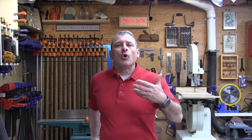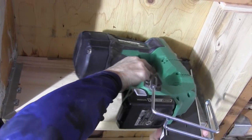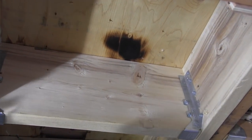Utilizing this sealed compressed air results in zero ramp-up time, allowing you to install up to two nails per second. The nailer is always at the ready — when you fire it, the fastener is installed with zero lag time and it's ready to go again, as the piston is automatically reset. One thing I noticed is that the recoil in this nailer is very similar to a pneumatic.